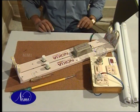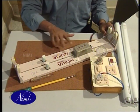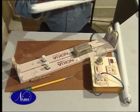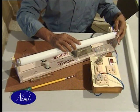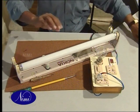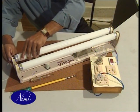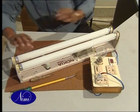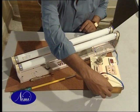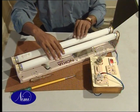After checking the accessories individually for their proper working, connect them as shown in the circuit diagram. A 40-watt choke and two 20-watt 110-volt starters are to be used for the purpose. Next, insert both the two-feet tube lights into their respective holders. Turn them by a quarter turn in their position and switch on the power. By adjusting the tube lights a bit, you could see both the lights glowing.